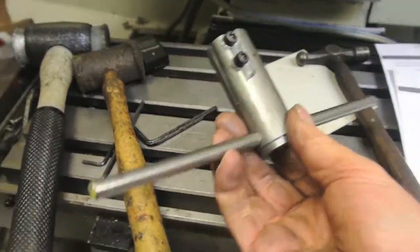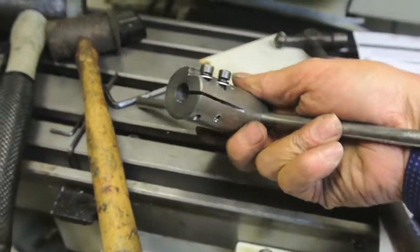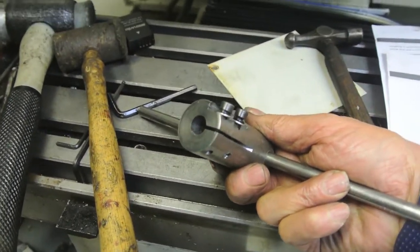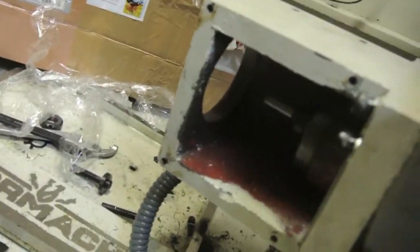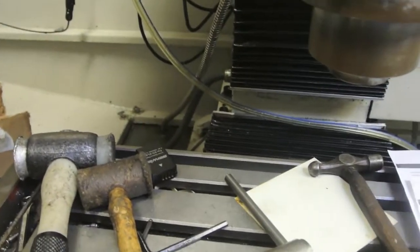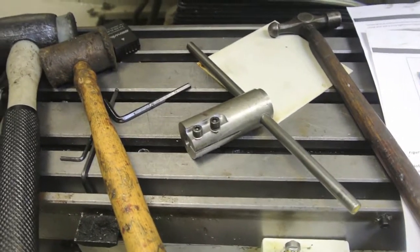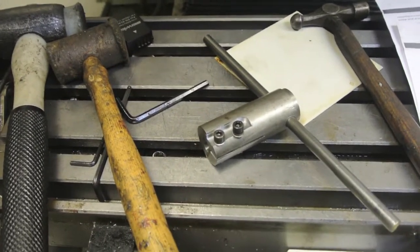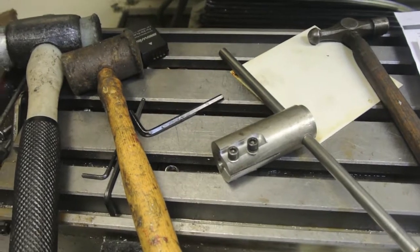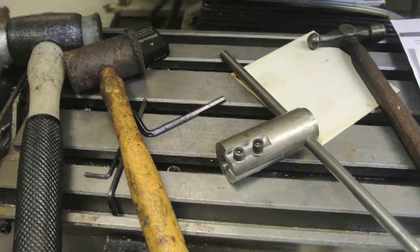About an hour's work, maybe a bit less, using some scrap from the stock cupboard and a bit of manual milling in the manual mill. I've made this tool which should go onto the end of the shaft here — you can just see it inside there. This will enable me to adjust the preload and tighten the two lock nuts up, and put the tab washer in and fold it over, without having to hold the shaft with pliers or any other makeshift tools.